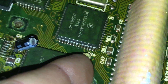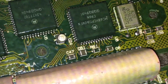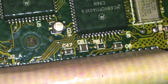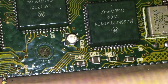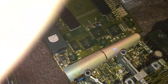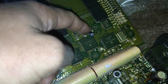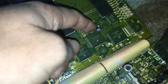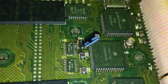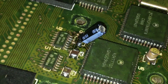This capacitor isn't the original one. What it originally looked like was this one right here. My dad was able to figure out which one we needed. If you can see it, it says N3P 4.7 25V on the top — 4.7 microfarads and 25 volts. The replacement we needed was 1 microfarad 50 volt, and we didn't have that capacitor. We pulled one out of a computer around the house and it wasn't even the right one — it was 3 microfarad 25 volt.